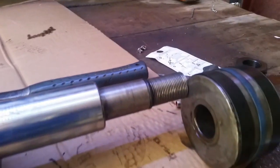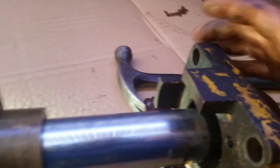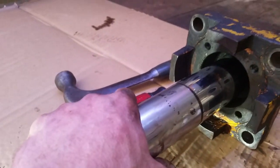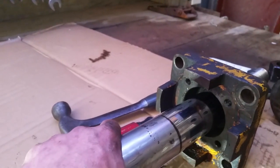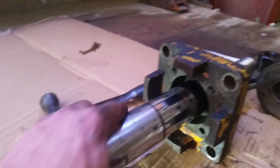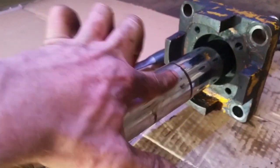It's incompatible with the new seal kits. Another thing I can warn you guys about repacking old cylinders is there's usually some damage to the cylinder - if somebody else repacked it before, there are going to be score marks. Also watch for the rod itself being pitted - you can see in there the rod's pitted a little right there. I actually haven't had any problems with the pitting causing it to leak - one of my boom cylinders is really, really bad and I'm surprised, but I repacked that thing and it worked great with no problems. If you can get these things resurfaced you're in a better position, because the worst case is that score mark can chew up that new seal.